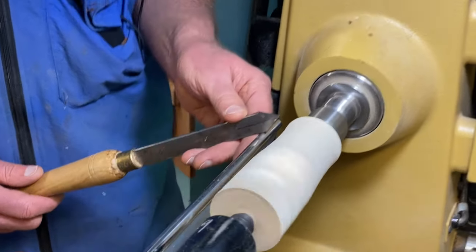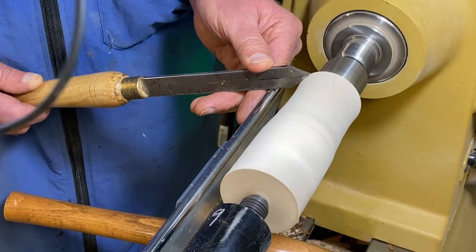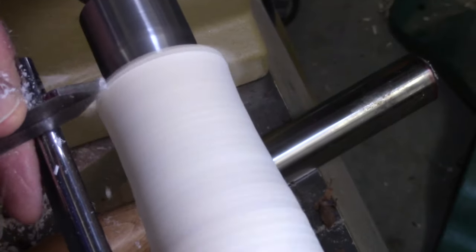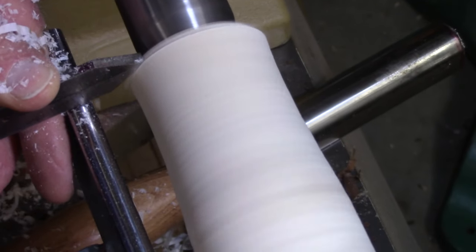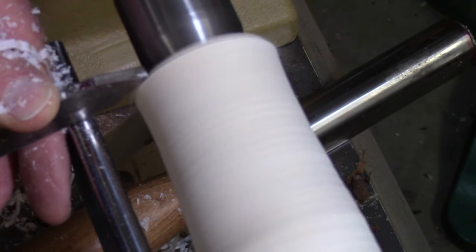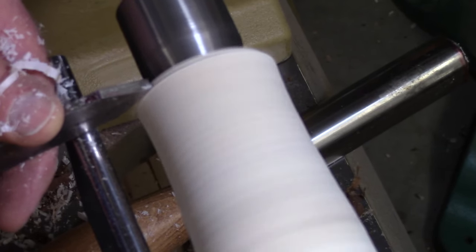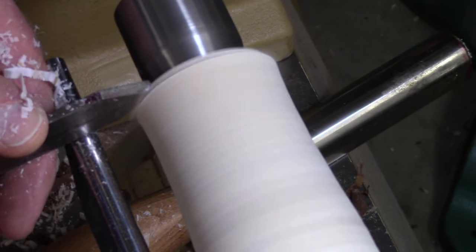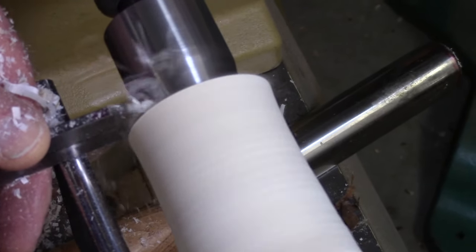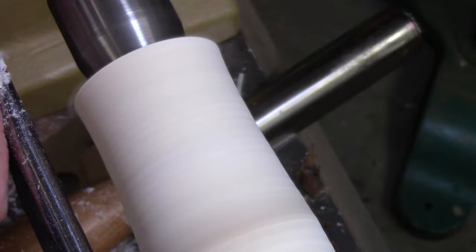This is going to require an additional step in the turning process for installing my chuck. So, find the bevel, bring it back, get that chip, and with the parting tool, I encourage my students to think of your arm as a pendulum on a clock. Rather than pushing in with your wrists, think about pushing forward from the back of your elbow, and you keep a consistent angle, and I'm going to bring it right up to the sleeve of the badger.